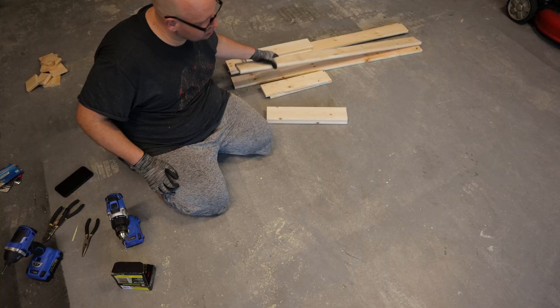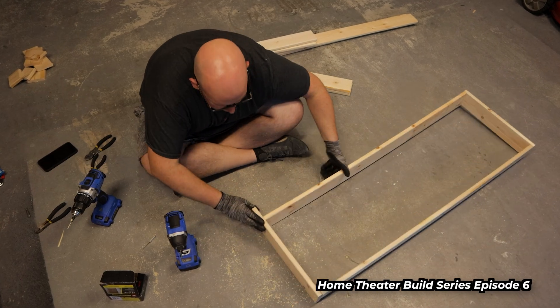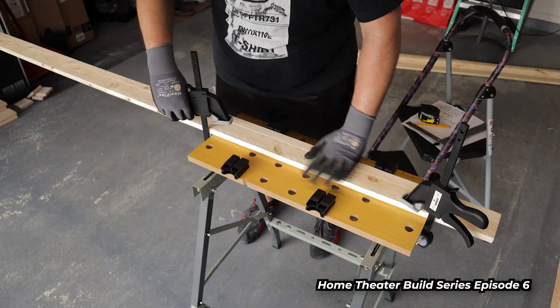Overall the clarity you get from all the speakers is much, much clearer. This is just a center channel - I could go through and measure each one but for this quick video I didn't. If I were making acoustic panels today, I would invest in better quality wood. The furring strips I got were the cheapest I could find - I had to go through them at Home Depot and Lowe's to find the straightest ones because they all had some bow or angle. I would probably invest in some higher quality pine or cedar, something already planed and perfectly straight. I would have spent more money, but it would have resulted in a higher quality finished product - though honestly after three years they still work perfectly fine.